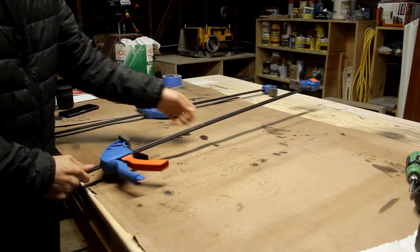This next tip I use a lot when I'm ripping material that's one and a half inches and thicker. This is just a scrap 2x4 here. But a lot of the times if you try to cut the entire thickness all in one pass, I find that it binds a lot against the blade and the fence, so I'll have to stop, drop my blade down, make another pass. To prevent that, I just start by only cutting halfway through the material for my first pass. Then raise the blade all the way up so it cuts the entire thickness and make my second pass.